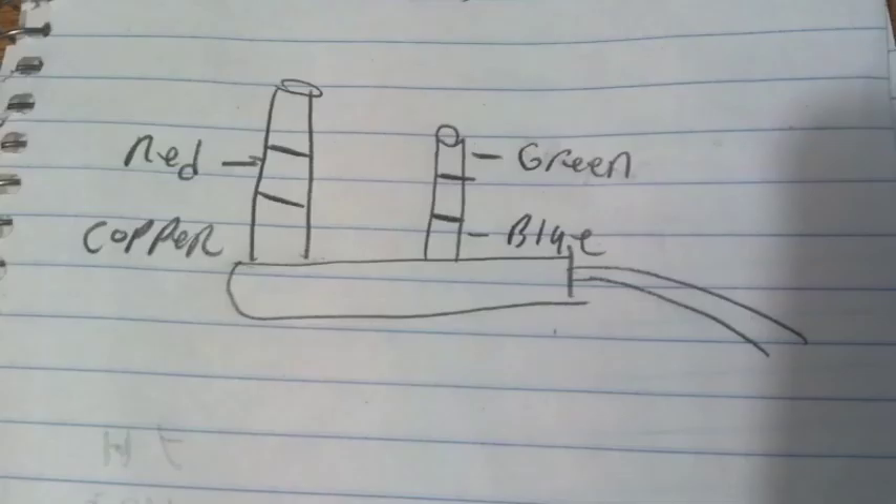Here's a diagram of where the wires connect to the cable that you need. You have your red, your copper, your green, your blue — your mic positive, mic negative. All that stuff is explained on the diagram. This is where the colors are and what they have to correspond to, because there will be other cables with other colors. So trace this with a voltmeter or ohmmeter just to make sure you get the right cable connection, and the other ones are not used.